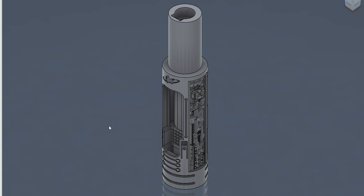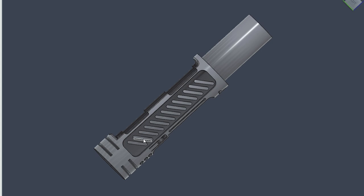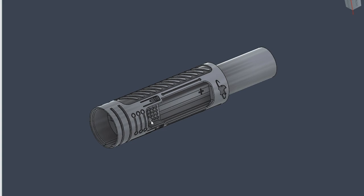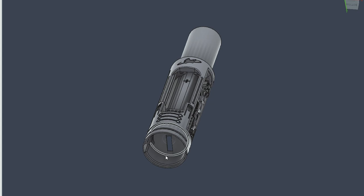Here's the chassis I designed for this hilt. I've got greeblies along one side, here is our battery tray. I couldn't get too heavy with greeblies on this side because I utilized that side of the chassis for wire management to bring my leads all the way up the side. I had a few down here — two for power because there's a kill switch in this chamber — two for power, one for negative, two for speaker — so I wanted plenty of room for wire management.